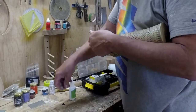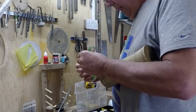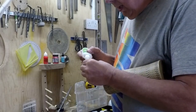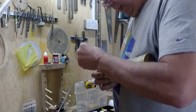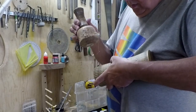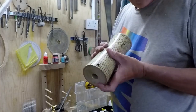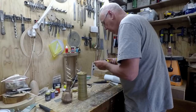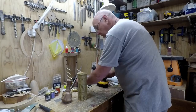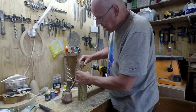I keep this half and throw the rest in the bin. You can get chrome finish, brass finish, all sorts of different finishes. The outer diameter and the drill hole are both 9 millimetres — it's an interference fit but the wood is quite soft. You kind of hook the base under your arm, get something to persuade it in with, and a bit of super glue — try not to super glue the metal to your fingers, which does happen regularly. Just a little dab of super glue, set it up, and that's a much nicer finish than just a raw hole in the wood. Ready for cabling.